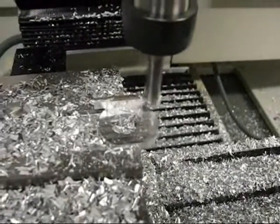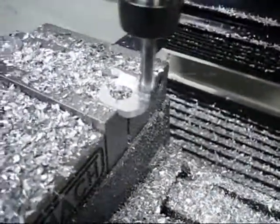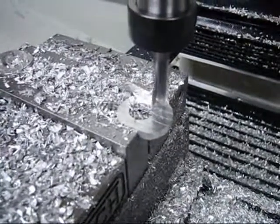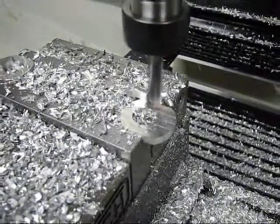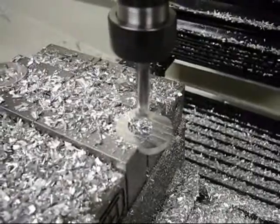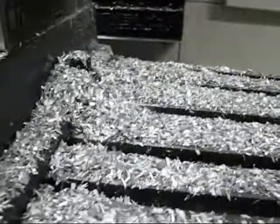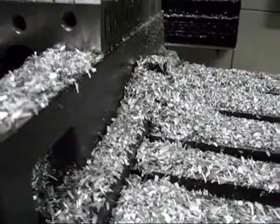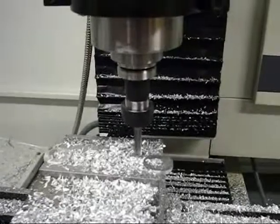And the last cut on this part before the chamfering operation. Just touching the coolant from the flood channel — trying to delay that as much as possible, because there's so much material here already just from today's removal on those parts. The parts are going to move to the tool change right now — that'll be it for this one.